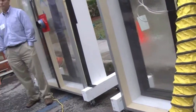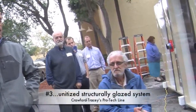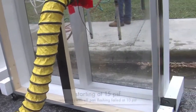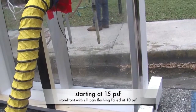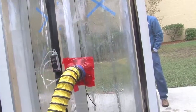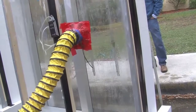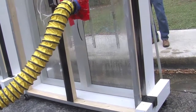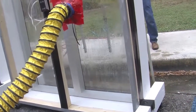So that's the type of thing that can happen in the field. We'll move over to the structurally glazed system. This is the unitized four-sided structurally glazed barrier type system. We'll start that off at 15 PSF, which is equivalent to about a 76 mile an hour hurricane type condition. The water pressure never changes — it's just a differential pressure based on the system and the project.